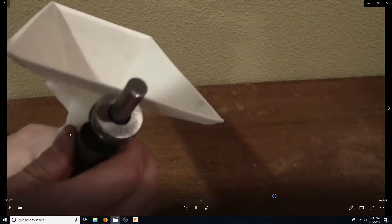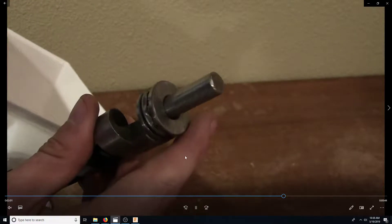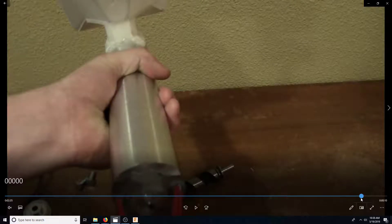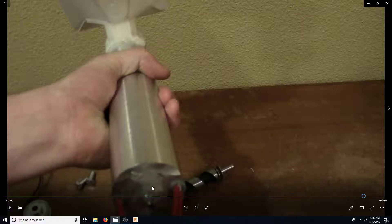Decreasing the screw size will also decrease the cross-sectional area so it heats up more inside the barrel. Here are two 40-watt cartridge heaters from a 3D printer. I didn't have a chance to put a thermistor in, but during the test I ran them all out and was able to start to melt the PLA against this nozzle — started to deform it a little bit. Usually in the extrusion process with a high-performance screw, 50 to 75% of the heat comes from the pellets rubbing against the sidewall of the barrel.